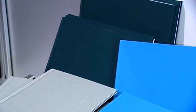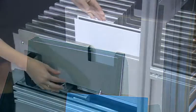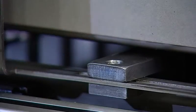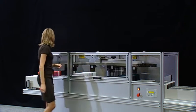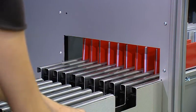The BCC10 is capable of processing books with various measurements and spine sizes. The book dimension adjustment is done manually. To provide maximum operator safety, the BCC10 was engineered as a closed environment, with both loading and unloading trays closed while the machine is operational.